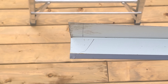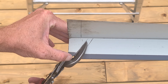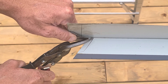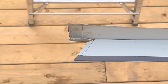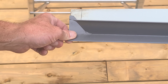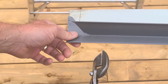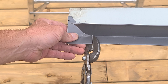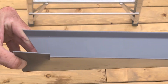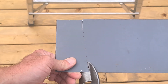Now we can start cutting. Start cutting from the drip edge side of the trim inward, cutting towards the top of the trim on our 3/8 inch allowance line. As we approach the end of the cut, angle your snips. Now spin the trim over to expose the panel hook — this is the one-inch lip I'm referring to. Make a cut straight across this one-inch lip and stop at the previous cut you just made. After that notch is made, spin the trim once more and cut across the top of the trim connecting to the last cut. You can now remove this scrap piece.